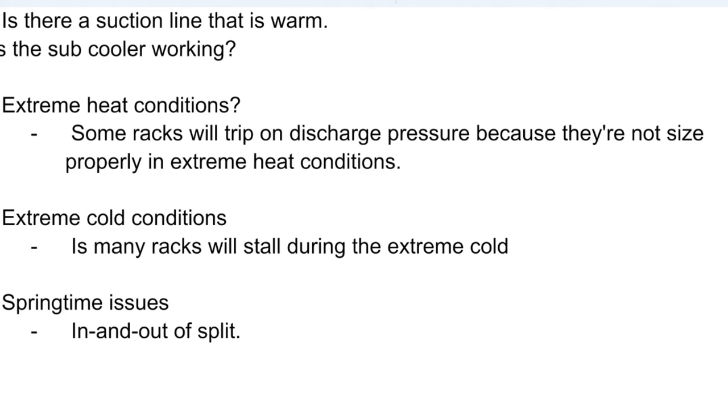So there's a couple ways of approaching this. One of them is, obviously follow your EPA guidelines. If you need to put a seasonal adjustment into some type of chart, do that. If you need to reach out for permission from the jurisdiction having authority, whatever you have to do. If you add some refrigerant to your system, with these larger systems, like if you have a 500 pound system and you add 10 or 20 pounds of gas, that gas will also stack at the condenser, but it'll raise the pressure at the condenser,